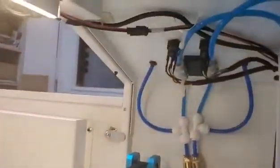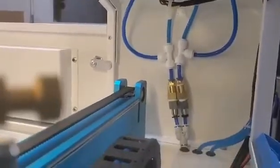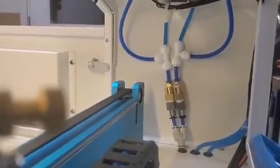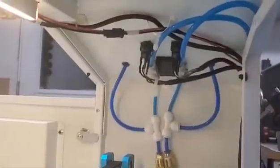You can see we have a little check valve there, keeping it from giving back pressure. That's the issue I was having — back pressure into the second gauge. Now that we've got that straightened out, everything seems to be great.